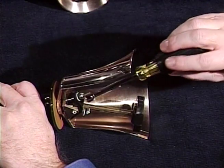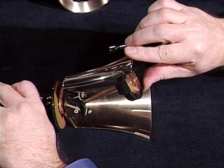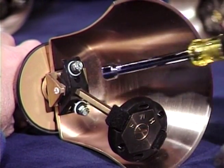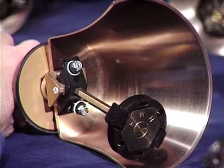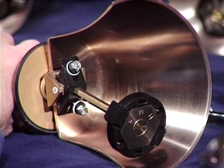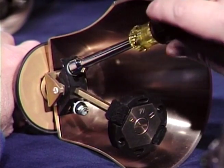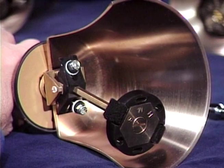Take your stop nut and rotate it to the right. Lift the clapper head up against the casting wall and drop. Continue to rotate the stop nut until the clapper no longer sounds on the bottom of the casting. Make sure that you don't turn too far, otherwise you'll miss the optimum point of tension. Now the strike point side is set.